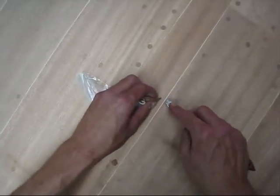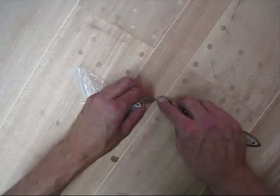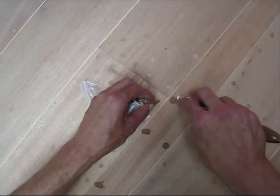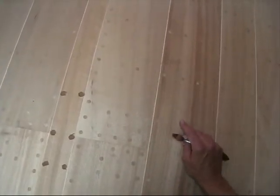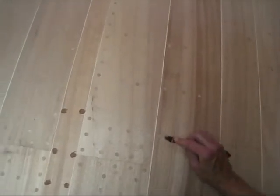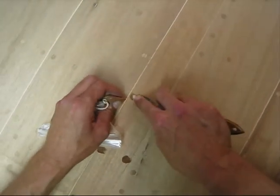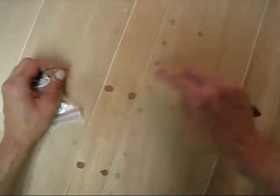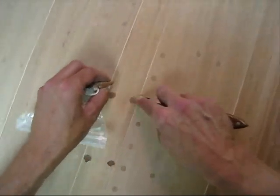This is a mahogany-colored Famowood — you can get it in probably 20 or 30 different colors. I've seen it used in large repairs, like a big gouge in the bottom or the side of a boat where people would just pack it in there, and it lasted. But I wouldn't recommend that. For any big repairs I would just glue wood in — you can make a Dutchman and glue wood in, or put a plug in a bung. But it's a real simple way to do small repairs — just put a little in a bag. If you're putting less on, it's going to dry faster.